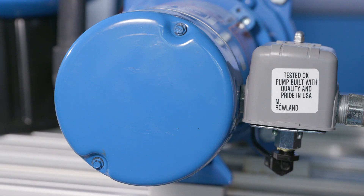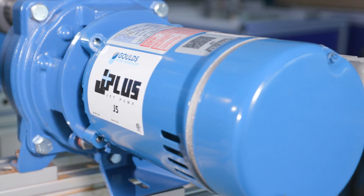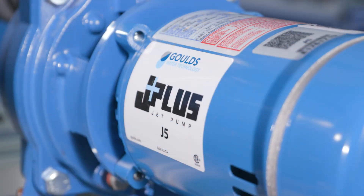Check power supply voltage and select the proper motor voltage. Jet pump motors have a voltage plug to facilitate simple voltage changes from 115 volts to 230 volts. If your motor is wired for 115 volts, operating at 230 volts will destroy the motor windings in a matter of seconds, and this will not be covered under warranty.